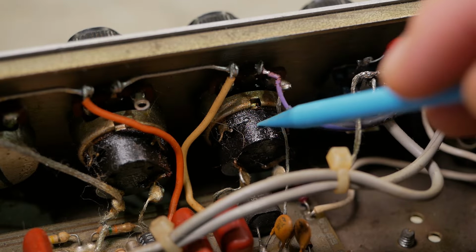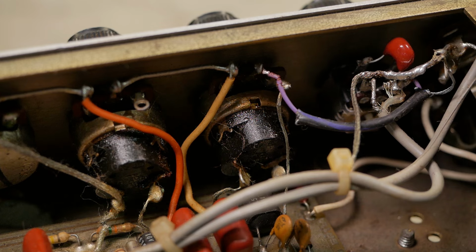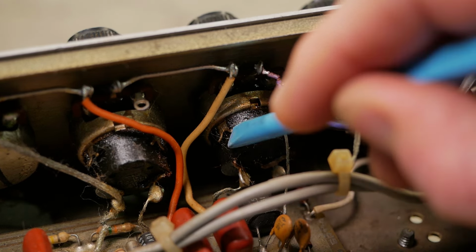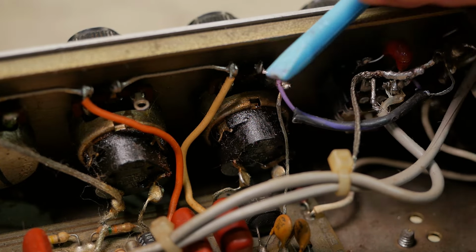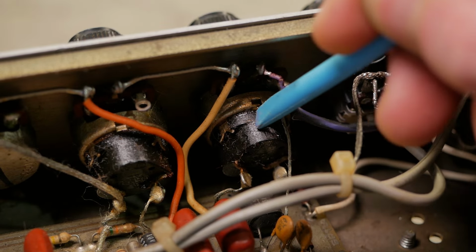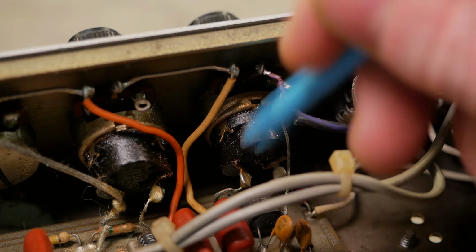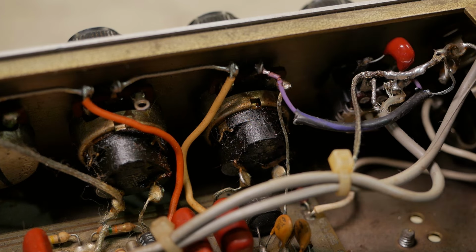And you've got what we almost always have, just a layer of grease and oil on all the pots because people just spray the living daylights out of them. And whatever that oil is, it's probably not suitable because it's gone hard. So imagine that inside your pot. It's turned into a crusty, imagine a boiled linseed oil sort of texture with dust in it. So that's all over the pot wafers now because they've sprayed it inside the pot as well as out.